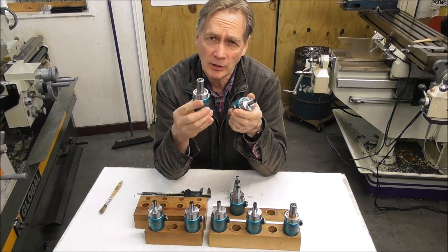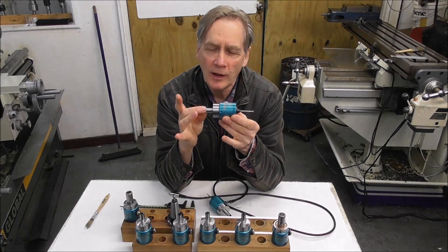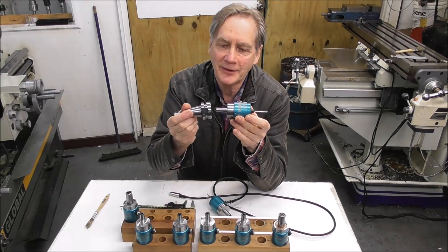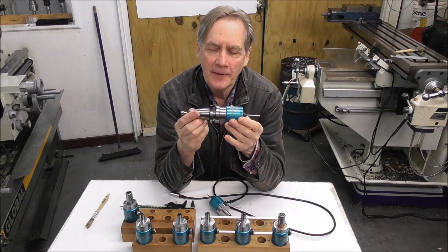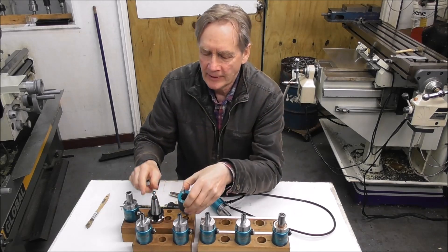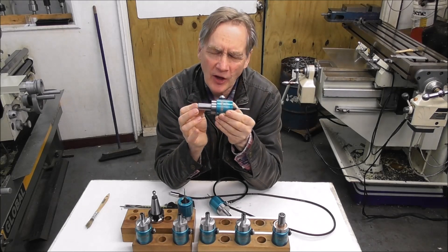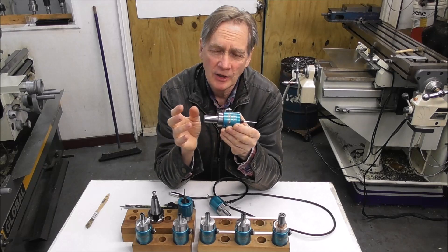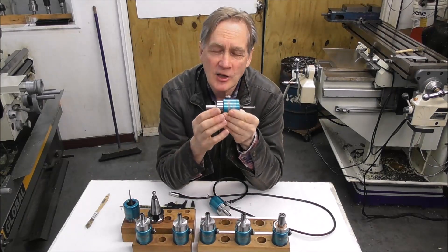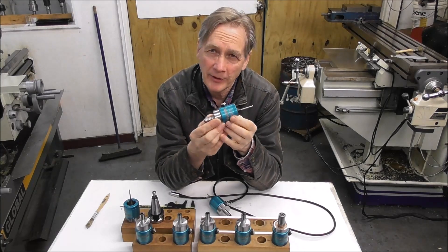But it's only been available in the three-quarter inch TTS shank. The ITTP is now available with this 12mm shank, which makes it a lot easier to suit different spindle types — for example, this adapter to BT30. These are readily available; I'll put a link in the description below. The traditional ITTP had just over 17mm of Z-retraction and a huge amount of X and Y. This new 12mm shank is almost as much — over 16mm of Z-retraction and the same amount of X and Y.